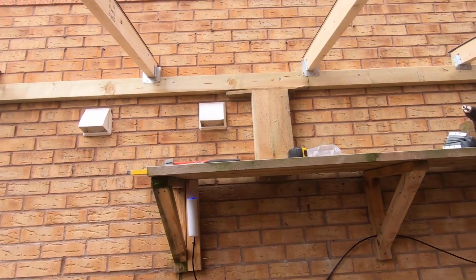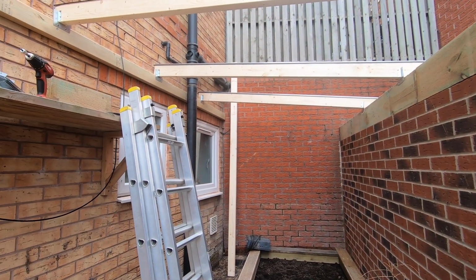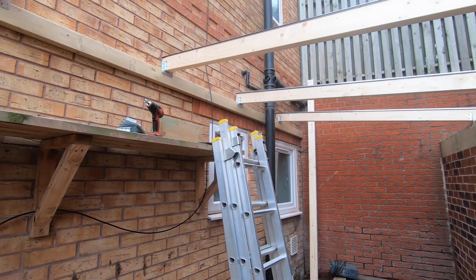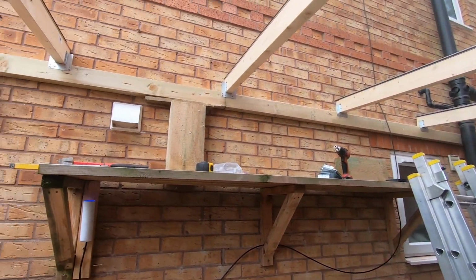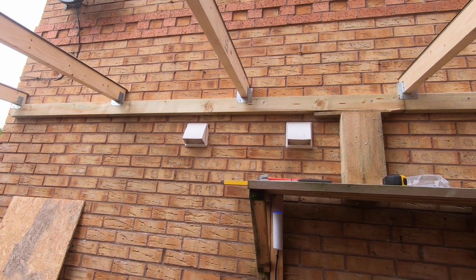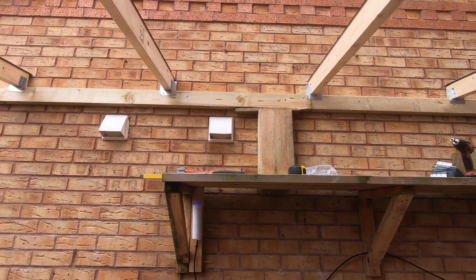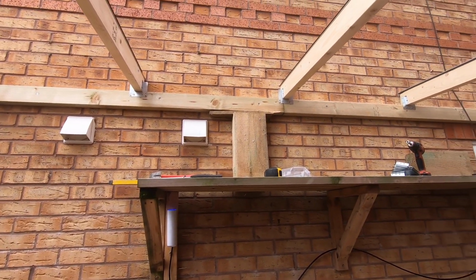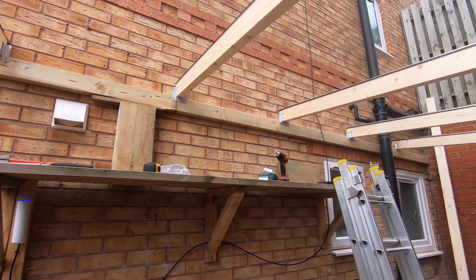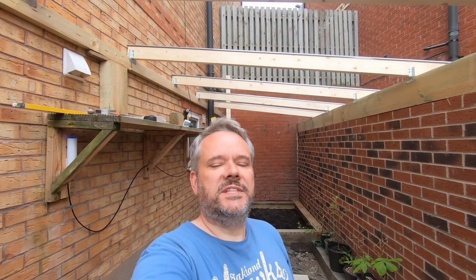We'll order the extra pieces that we need and get them here as well, and throughout the week hopefully the roof should come together. But I think the next thing to do is to take the mortar out, ready for the flashing to go up, and then as the flashing goes into position and we can refill it, we can start putting the polycarbonate up and moulding the lead flashing to that. So it's all coming together.